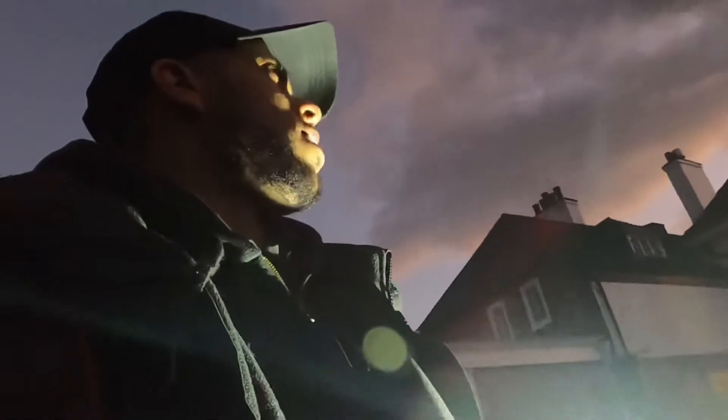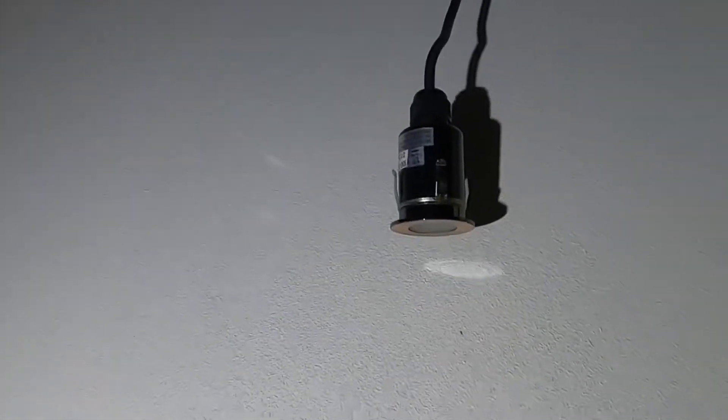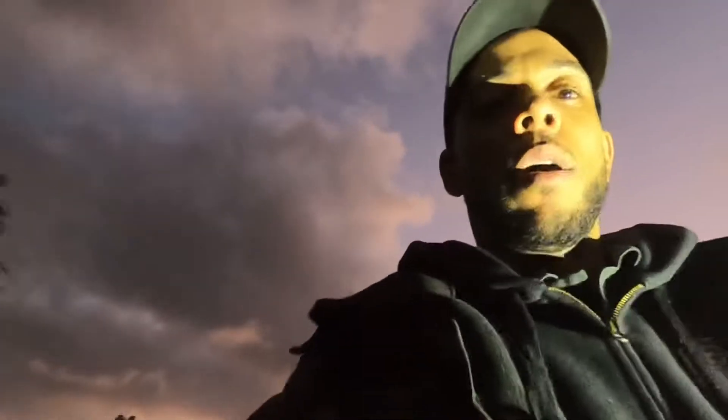Right, so this is what I was saying about the sleeve. There it is — that sleeve should have been recessed and fixed into the timber, and then the light has its own clips and would hold and slot into the sleeve, sitting nice and neat. Instead, they've removed the sleeve, made the fittings fatter with tape, and just wedged them up there. But we'll get to the bottom of it.